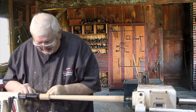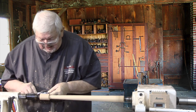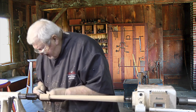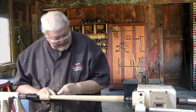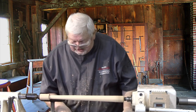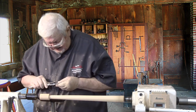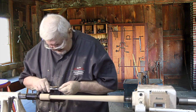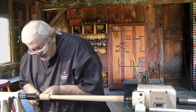So I'm going to take and mark. So I'm going to work from this end back. So this is going to be 6/10 down here. It's that same diameter. Get my pencil. So 6/10 is about like that. That's a little proud of 6/10, and that's just fine. It's got to be 0.75 at the top. So it's going to be that big around at the top. And I'm going to try that with the peel cut on the skew chisel.